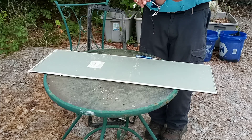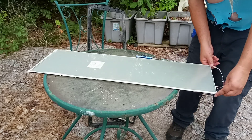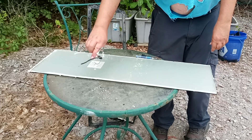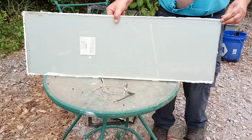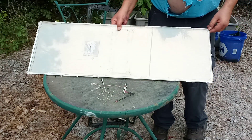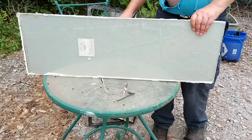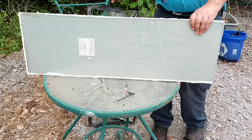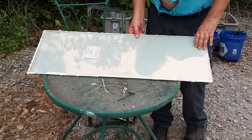Inadvertently I pulled the wires off, and it seems that the negative was attached here and the positive was attached here. The ease with which the negative came off led me to suspect that was probably the problem with this panel. The wires just were not attached all that well, and of course the flexing and whatnot — this plastic construction is just not a very good way of building a panel.